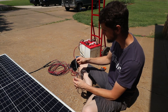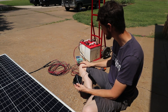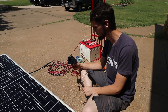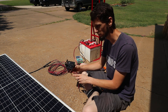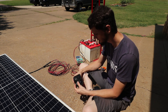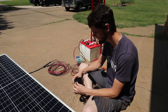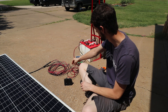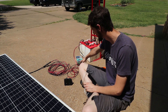This is a pretty cool simple setup — maybe a starter system that you can expand by adding panels or going to a higher voltage battery pack. This gets you your 12 volt accessories. You are limited to 5 amps on this output, so don't plug an inverter into here. But you can charge accessories and run very small 12 volt loads, and you've got a flip switch to turn it on and off. If you try and use more than 5 amps, the fuse should blow and protect the charge controller.